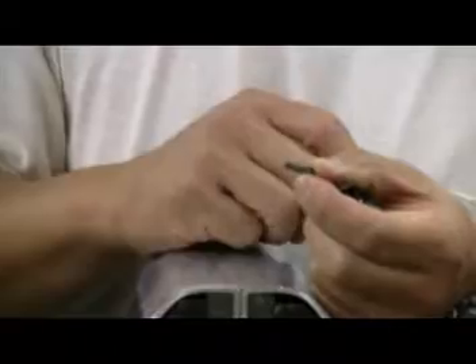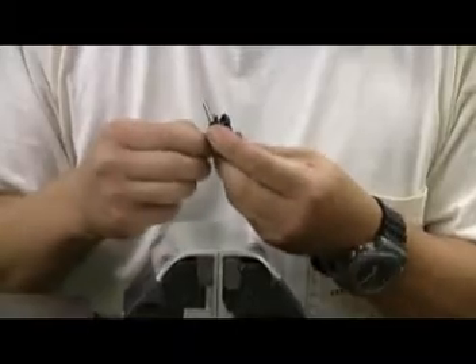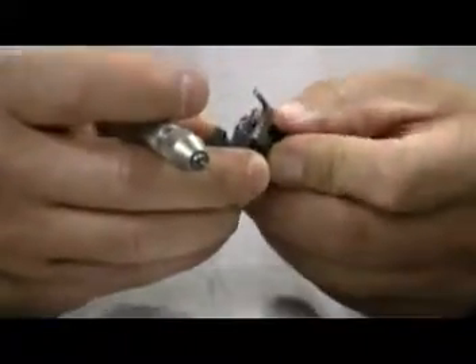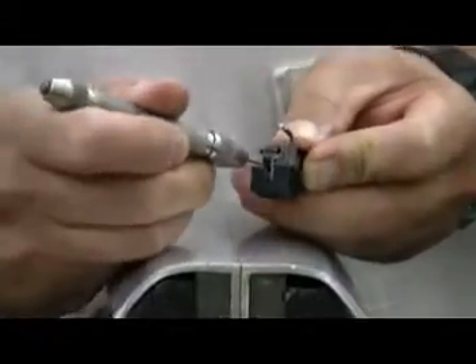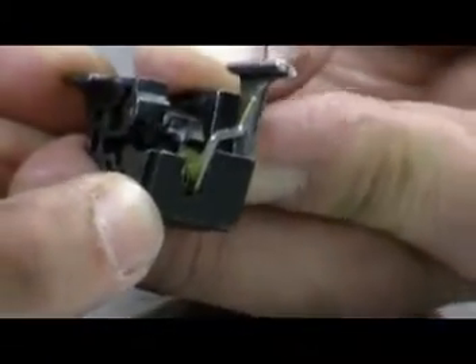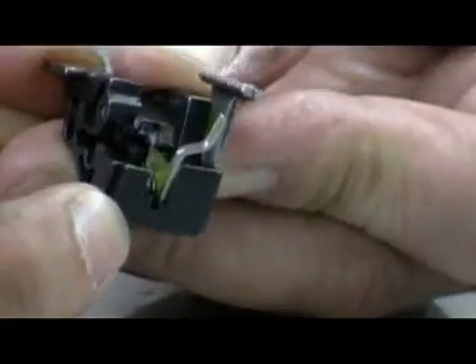So I'm putting the spring over the body, the main shank, and then from the left side I'm installing the RAM through the hole. The flat that's on that portion of the body needs to be facing up. It's kind of hard to see because of the heat treating surface, but the flat that's cut into the notch on that bottom portion is what pulls the trigger bar underneath.